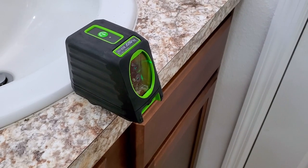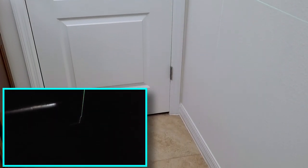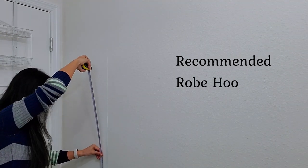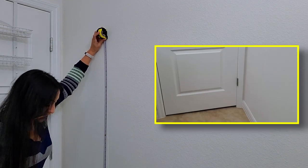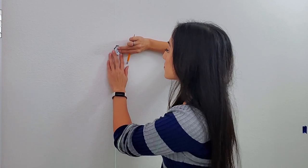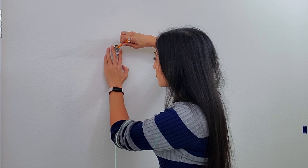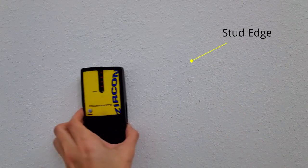Here is the robe hook. I'm actually using a self-leveling laser — it's hard to see with the studio lighting on, so I just wanted to show what it would look like. I will also place a link below for this laser. The recommended height for a robe hook is about 70 inches. I measured the height from the floor and had my laser positioned between two tiles — that's how I wanted it to hang. Then just place your mounting bracket, trace out the holes.